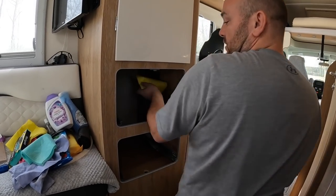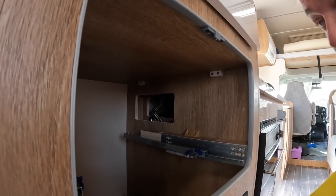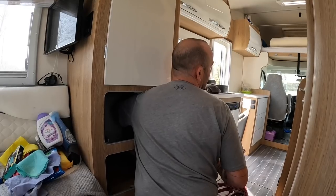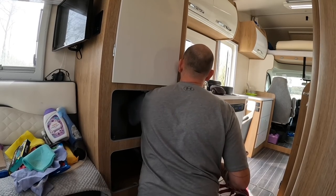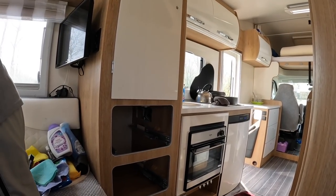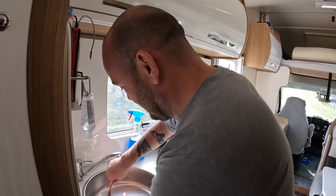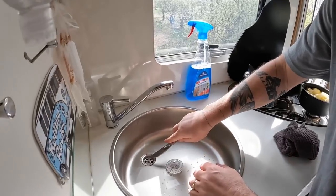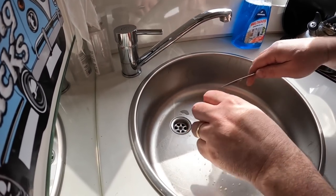I had noticed when I had the drawers out a couple of weeks ago there was a bit of wood fixed on top of a hole — I knew that was going to be an access point to the plumbing. It's really tight in here, so I'm just gently trying to get a cloth underneath — the oven is here, there's woodwork here. I've found the fitting and it's loose. I'm trying to take it out; there's a flat head on this. Luckily I do kitchens for a living. Look how loose that is — there's our little fitting there that needs tightening. It's still not brilliantly tight.